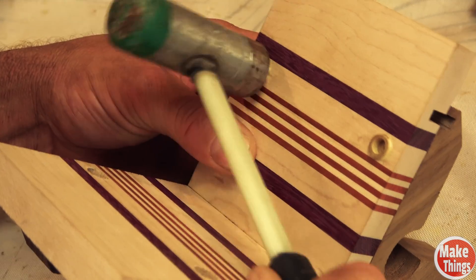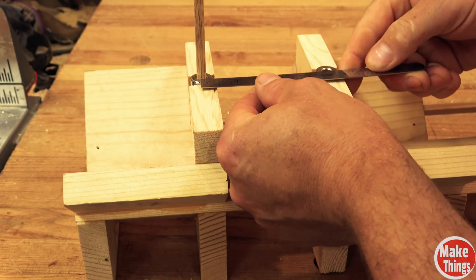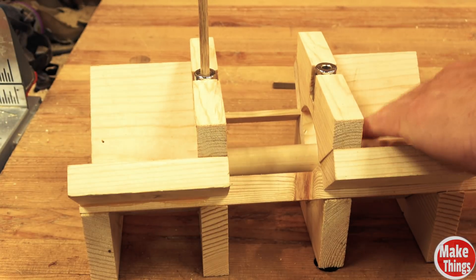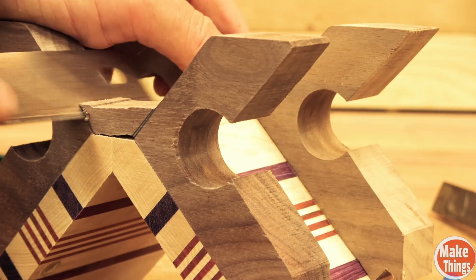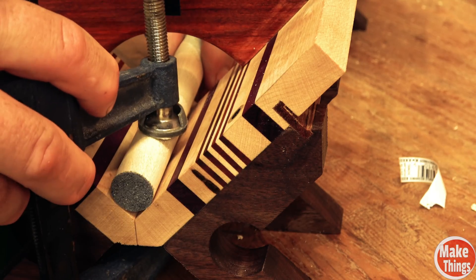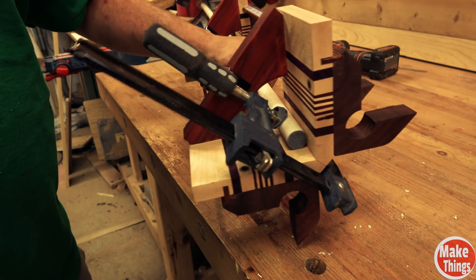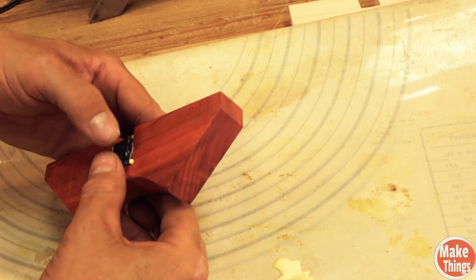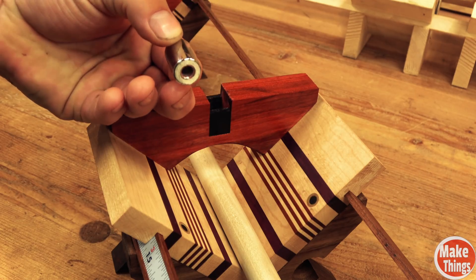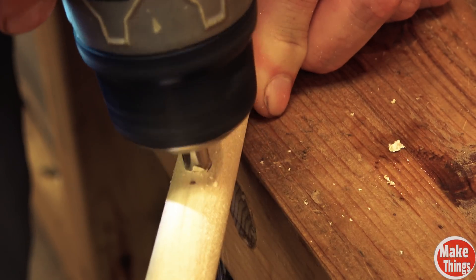Adding a measuring tape to the strip is easily my favorite improvement — it makes the painful act of trying to measure by finding the center of each hole a thing of the past. I can't tell you how many times I've been just slightly off. I also made the bottoms of each sled flat. This seems like an odd addition, but I got tired of trying to hold tubing while using my hand drill. Making clamping possible helped greatly, and also helped with drilling at angles — something I've been working on. Lastly, I added small walls around the spacer that allow me to remove each spacer and use different sizes, though I still prefer using center-finding drill bits to enlarge the holes to the sizes I need.